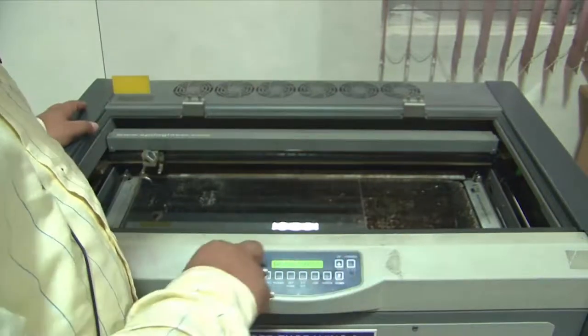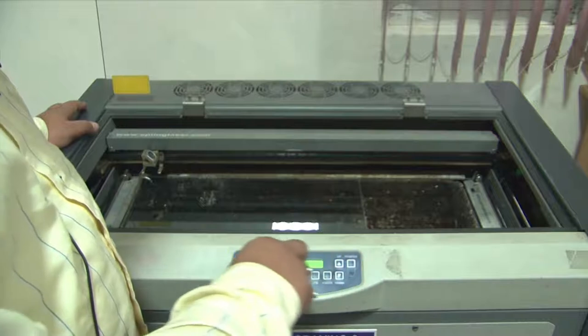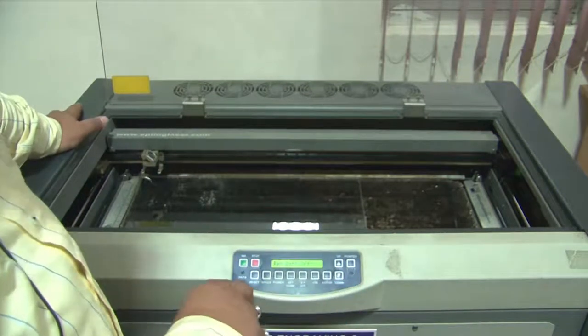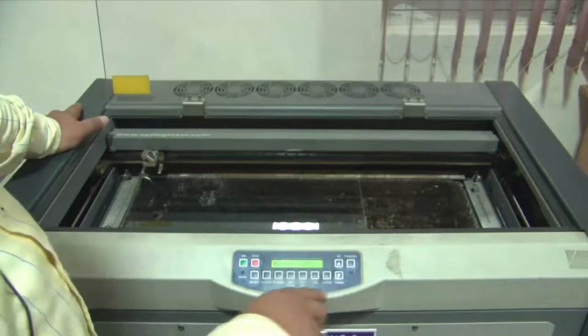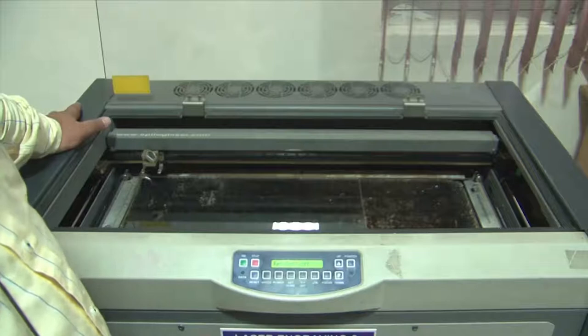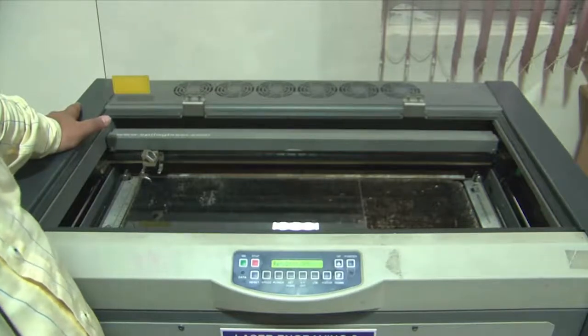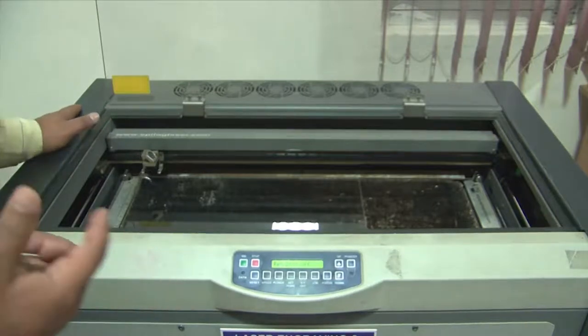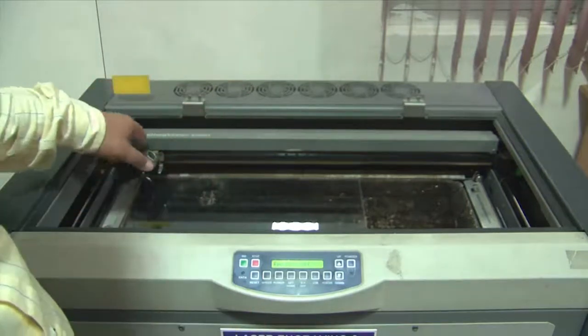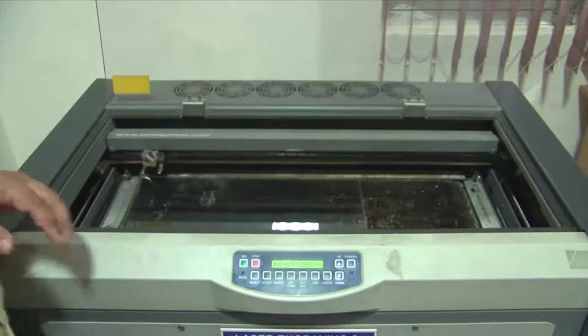So electronic data or numerical data comes on to the system and makes the controller execute different motions along the different stepper and analog motors which are available and the drives therein, so that all this mechanical action of scanning, rastering, etc. can occur of this head on the top of this whole workpiece surface.